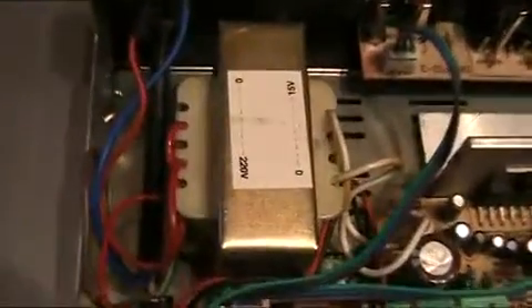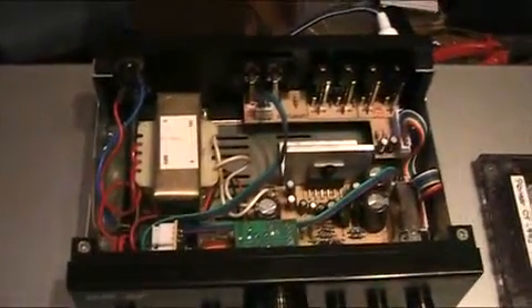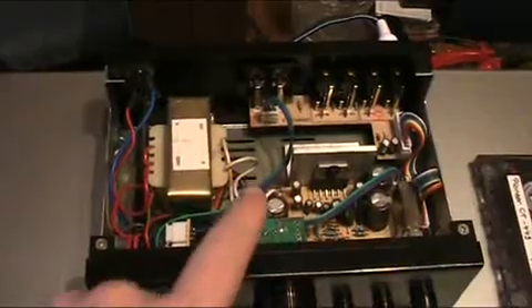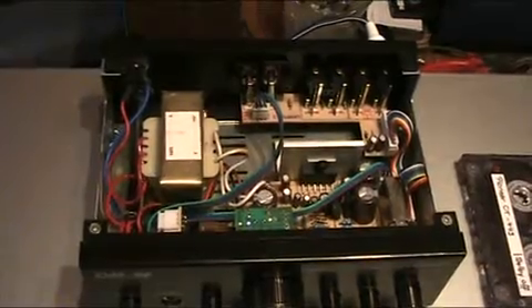I'm probably going to replace the fuse with a smaller type. The transformer is not very big, but one special thing is that all the voltages are marked on it. The transformer puts out 15 volts AC, which is already near the maximum the chip can handle — rated at 18 volts. Taking 15 volts AC through the rectifier and filter capacitor gives you about 18 volts DC, so that's all fine.